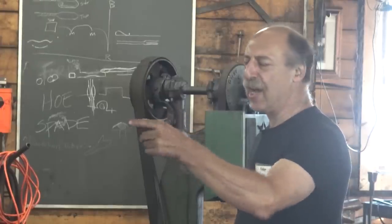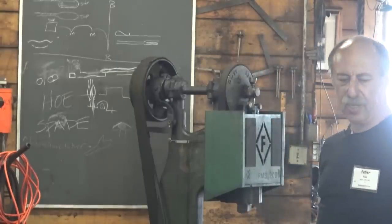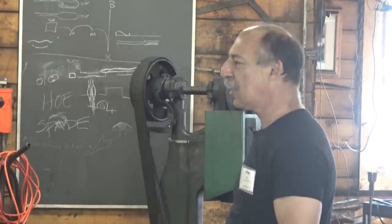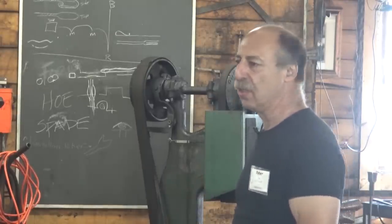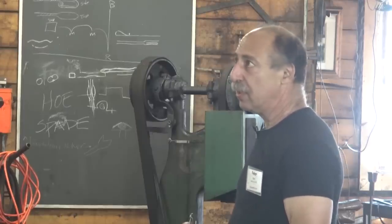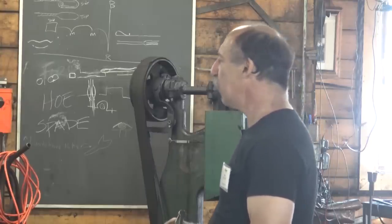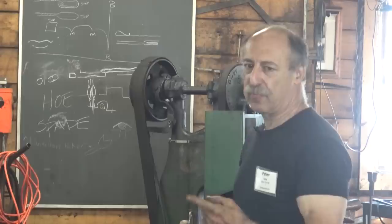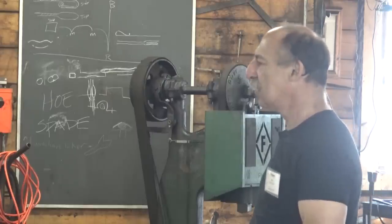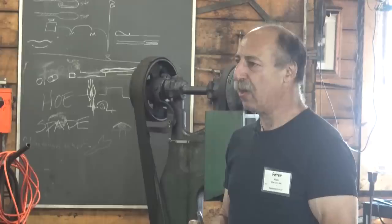So let's see, in that lock, the spring is steel. That's the only piece that's steel. In a common door lock, there's even less steel than there is in that lock. There are two springs in a common door lock. Everything else is wrought iron. Even in a gun, the amount of steel is minimal. There are three springs in the flintlock: the frizzen spring, the main spring, and the sear spring. And that's all the steel there is in the flintlock. The barrel would have been wrought iron? The barrels were iron.